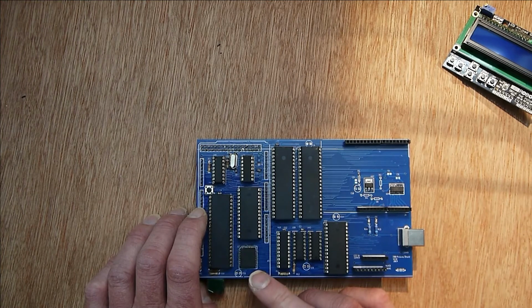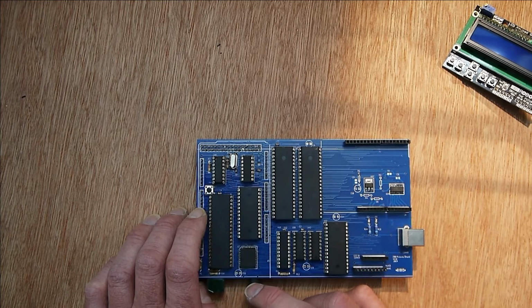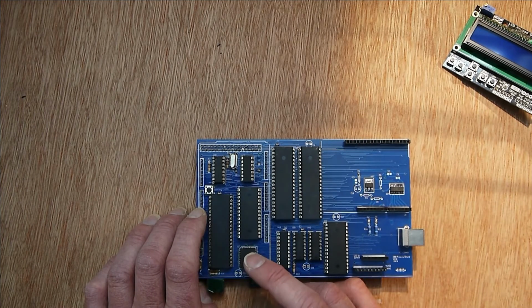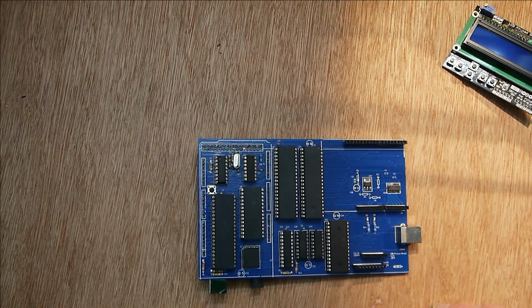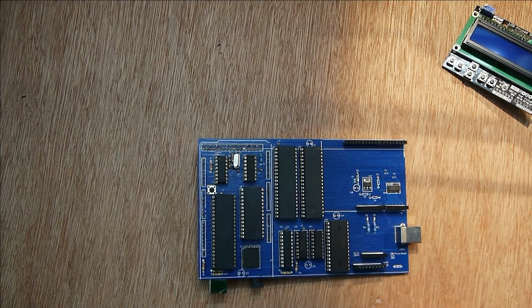So you can actually run the code that is in flash or RAM. You can run that code using the Mega to clock it and the Mega to monitor it, and you end up with a full bus analyzer and sort of in-circuit emulator as well. You can look at every single signal on the bus using the Mega on your PC over a serial link and watch the code execute, and you can see every single edge on the bus. So every half clock cycle you can watch, and you can watch the Z80 do all sorts of things that you don't normally see. On the microprocessor you can run code, but basically you don't see any of it execute. You just see the results of it in memory or on the display.